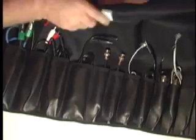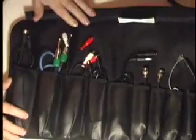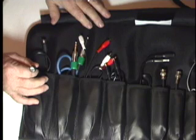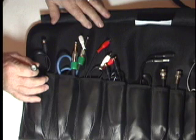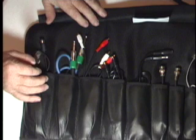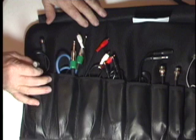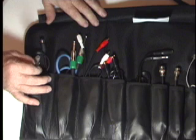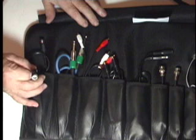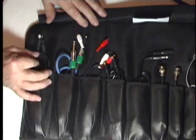These are the cables that are on the website. The first cable I have is an F connector. It is used for RF, usually carrying channel 3 or 4, or any other channels you want to carry if you have cable or whatever. This would only carry one signal through the cable, but it still utilizes your mic cables to send a signal through. This happens to be a push-on type F connector, so that's why it may look a little different than what you're used to.